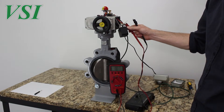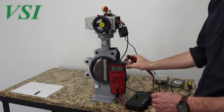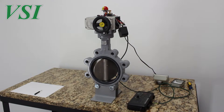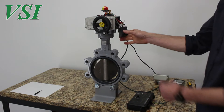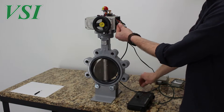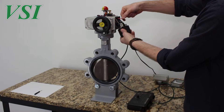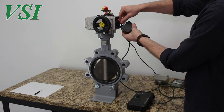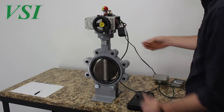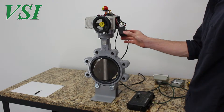Remove the leads from the multimeter and set it aside. Pull the two wires from the potentiometer connector and carefully reinsert the connector back into the servo control pack. We'll quickly go through setting the actuator back up — for detailed setup please see our complete Series 1000 setup videos.